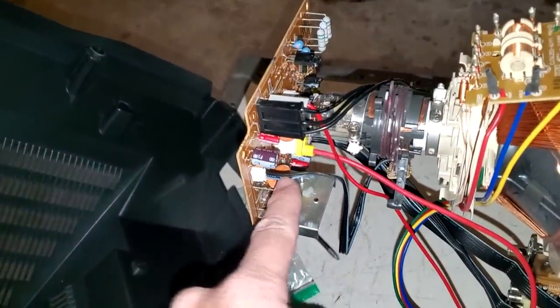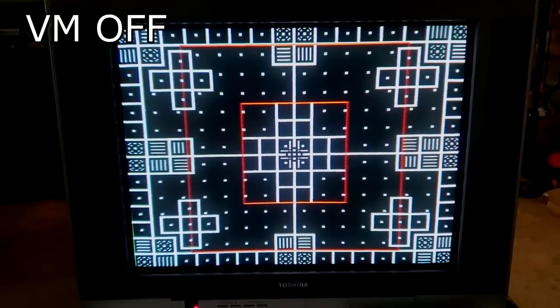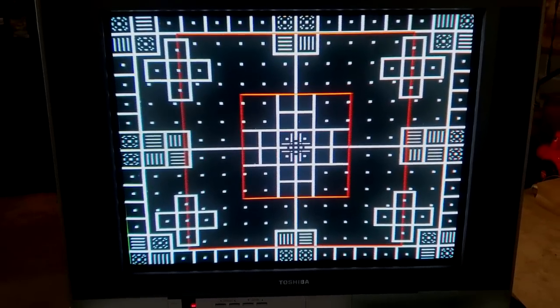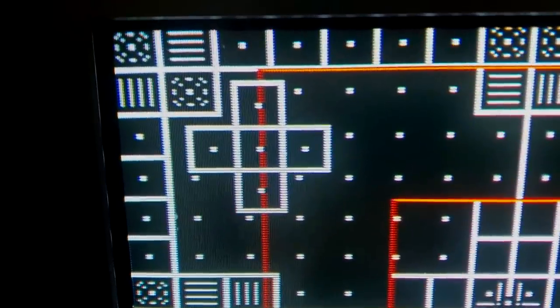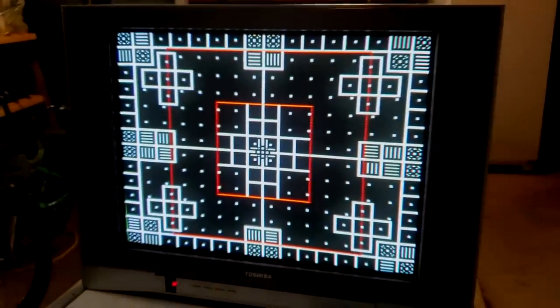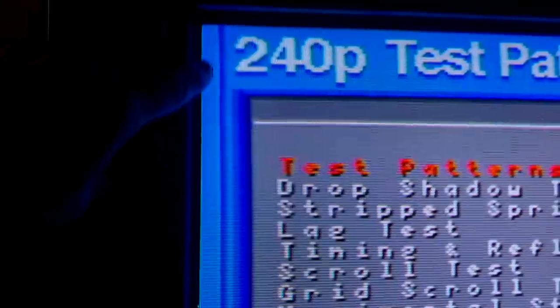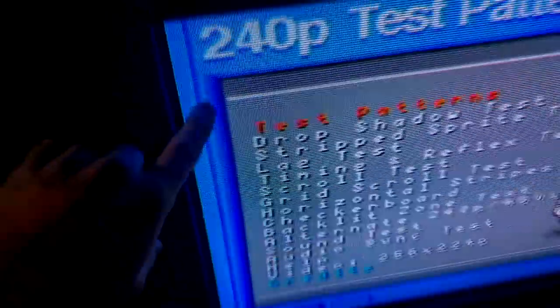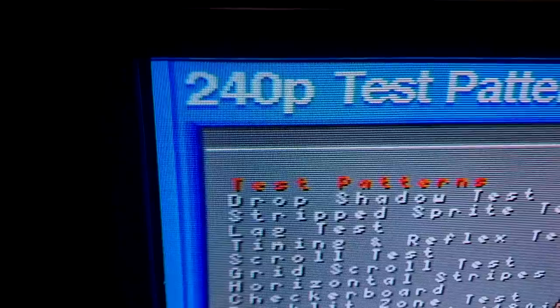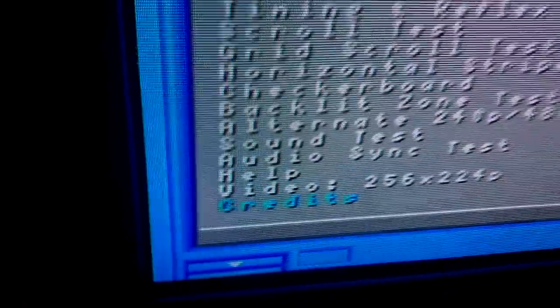Disconnecting that cable turns the velocity modulation mode off. Without the velocity modulator, a lot of the pronounced hooking in the corners has blended out — there's still a little bit of misshapedness but it's not nearly as pronounced. It does still look a bit wonky with some corner hitches, and hasn't removed every hitch on the screen, but it does look smoother. These remaining hitches will be part of this flat screen tube. When you have velocity modulation engaged it does improve sharpness but results in poor geometry — the softer edge actually looks better personally.